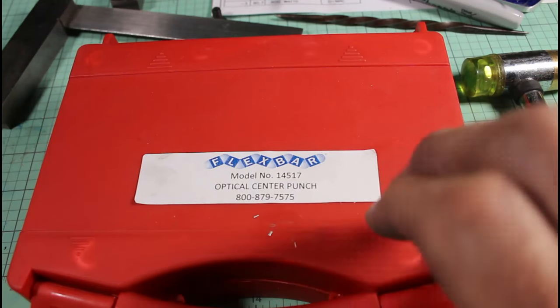The advantage of motorizing the carriage is I can just reverse whenever I want to, which is really convenient for a cut like this. And of course I can stop and start anytime. The motor shaft is 12 millimeter diameter, so I'm going to start with a center drill, of course, and then since I don't have a 12 millimeter drill bit, I'm going to go up to a 15/32 and possibly bore out from there. We'll see how it fits on the shaft when I get there.